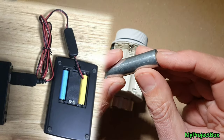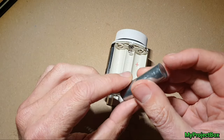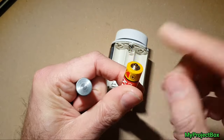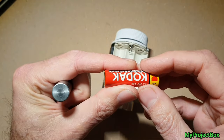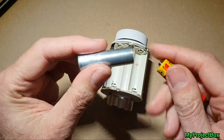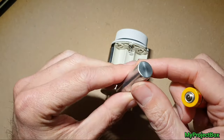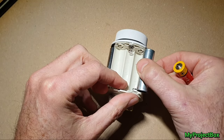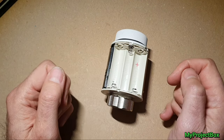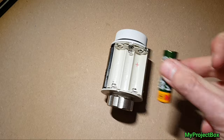You can buy dummy batteries to connect to terminals like this — there's nothing new about that and they're very cheap. But I thought I'd give it a go since I have some old spent batteries. I'll just cut them open to get rid of the electrolyte inside, which on zinc batteries is quite harmless and fairly benign. We'll empty it out and have our dummy battery spacers. The other option is to solder straight on there, but I'd like it to be fully reversible so we can still put batteries in future if needed.